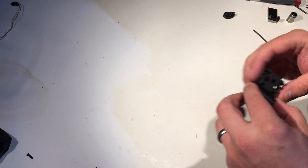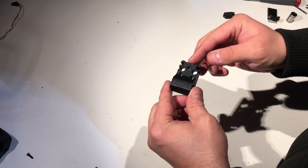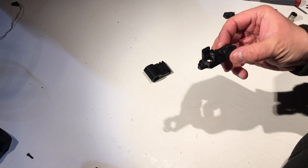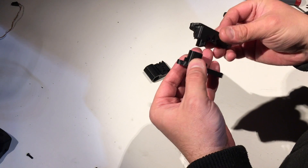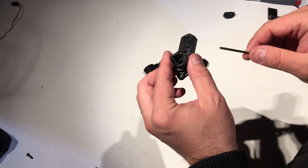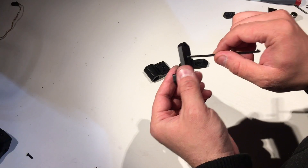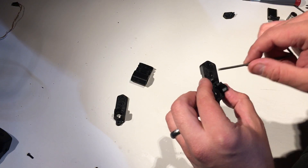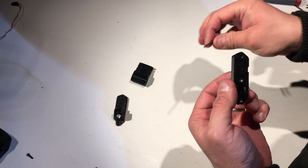To assemble the X-carriage, you will need the X-carriage hot-end mount, which swings back and forth, and the two X-carriage pieces that are in the rear. Do make sure that you install the nuts in the pockets for the belt clips, and same over here — you probably want to install these nuts as well for the actual carriage bolts.